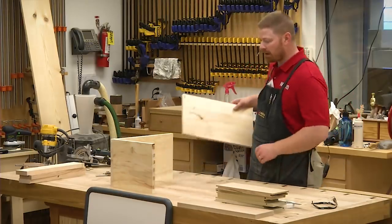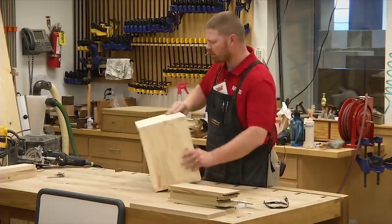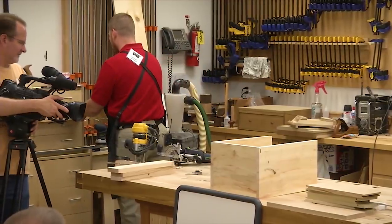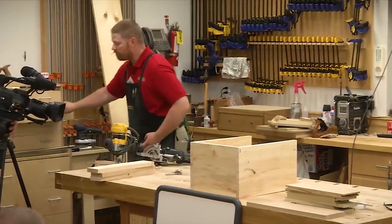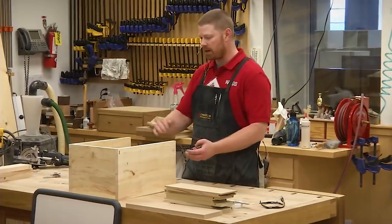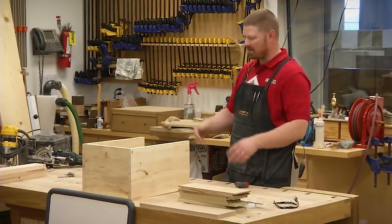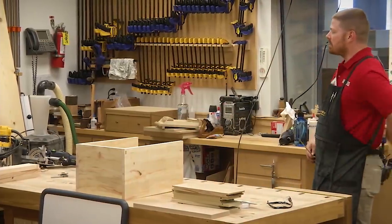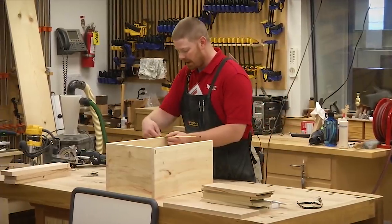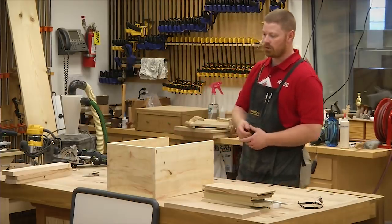This is also really nice. It's something I like to do when I have to start dealing with drawer guides. I forgot to measure to double check. I'm not saying this wrong because I can never remember. Side mounted guides typically are half an inch on either side, so you have to subtract an inch from the opening. And that's assuming that the front of your opening is the same as the back of your opening. Hopefully it is. So for this style, let's say I have 12 inches. I need to subtract the thickness of this, the thickness of this, and come up with my drawer front.